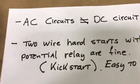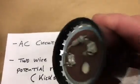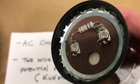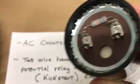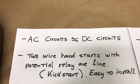Just a couple of conclusions: AC circuits don't behave like DC circuits, and the bleeder resistor is the evidence that this capacitor is not sending a big charge to the compressor — because there is no charge left in it. All it's doing is causing a phase shift between the start winding and the run winding to create the starting torque.